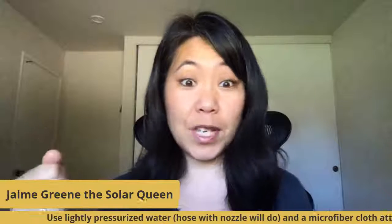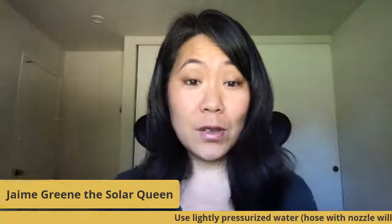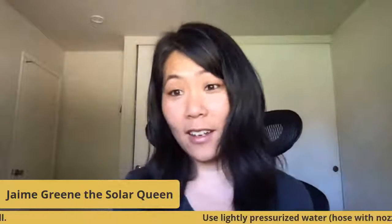So use lightly pressurized water from a hose with a nozzle on it. You don't need to make it like a laser stream. And if you have access to one of those poles, kind of like a mop with a Swiffer on it, you don't use a Swiffer, but use a microfiber cloth, which is really, really gentle. You can go to Costco and get those 20 packs of yellow microfiber cloths. A lot of people use them for waxing their cars. So if you can wax your cars with it and not scratch the paint, you can clean your solar panels with the microfiber cloths.